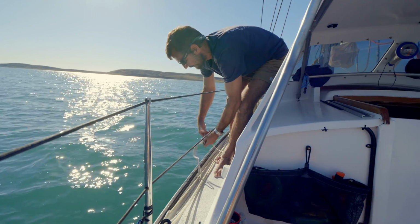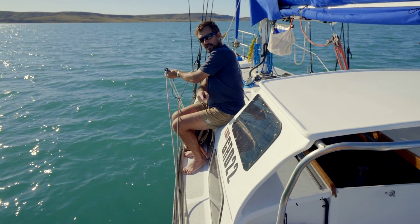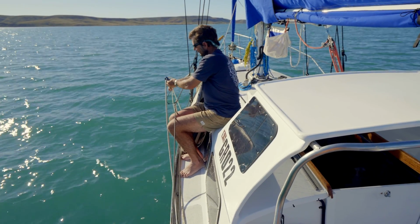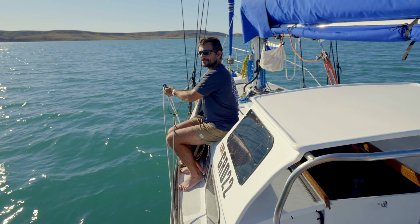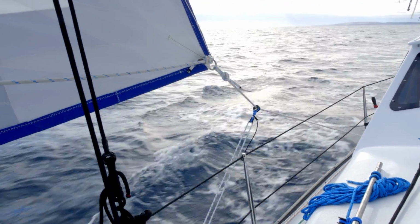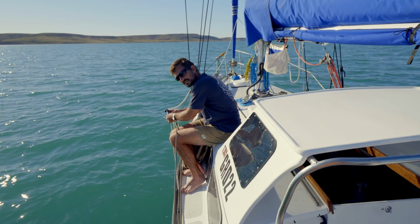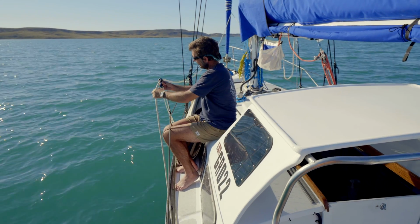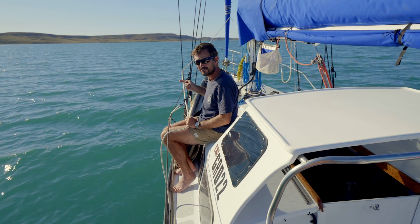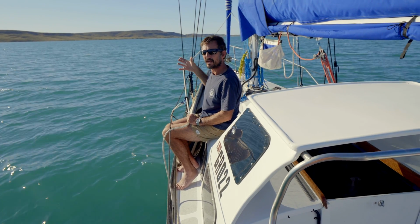And then if we go and see where this leads to, we'll see where it becomes a 4-to-1. So by pulling on there, this comes through and it will pull down on that. And because we've got 2 ropes supporting it, that's a 2-to-1, there's a 2-to-1 back there, it's a 4-to-1. The reason we did it like that is because with just that little skinny rope, we have to be able to pull down against the force of the sail. In any case, when that pulls down like that, instead of pulling along the foot of the sail, it pulls down along the back edge, the leech of the sail, and that makes it more full.